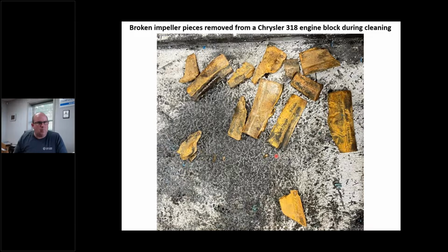So what do I do, right? Now I've got a problem, maybe on my fresh engine, or an engine we did the heads on years ago or whatever, that all these chunks are laying in the motor. They're stuck in a manifold. They're stuck in a thermostat housing. They're stuck in a hose, stuck in the water pump cavity. That's why I always like to tell our customers, change your water pump before it gets to this. When it gets to this, it sucks.